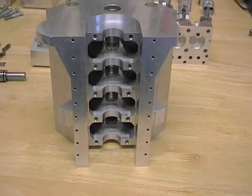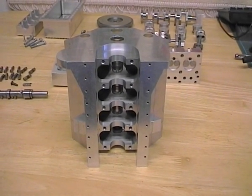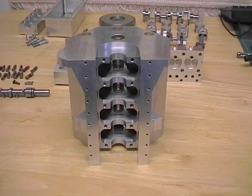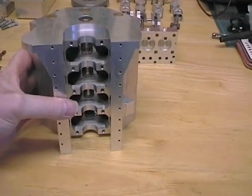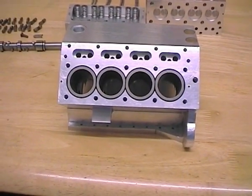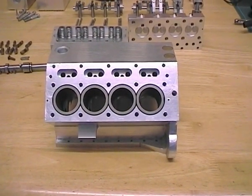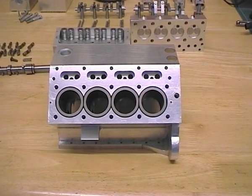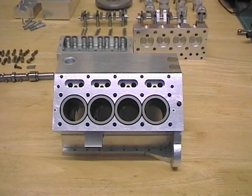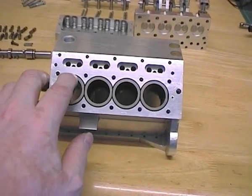There was a lot of work doing that. When I made it I didn't have a DRO on the milling machine, which I know now is a mistake — I have a DRO now and I wish I could turn back time, because with a DRO you get all the positions for all the holes and cylinders exactly where they should be. As it is, the cylinder head for the left bank will only fit the left bank and isn't interchangeable to the other side because of slight differences. With a DRO they would probably have been interchangeable. I've also made a slight gap in between the liners.